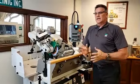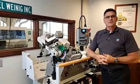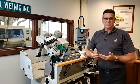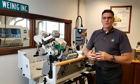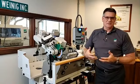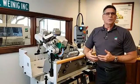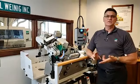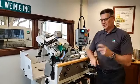A lot of times, just maybe going off on a tangent on that question, the reason for a metal template is generally for a very intricate profile where we got some blends coming together, but we're going to run it over and over and over again throughout the course of the year. Or we get into where we have a lot of multiple knives and we're doing a joining process where the guy standing here is trying to grind 4, 6, 8, 10, 12 wing tools, and they got to be accurate from one to another. So there's different wheels we would use, and would certainly prefer a steel tracing pin at that point. Hope that helped.